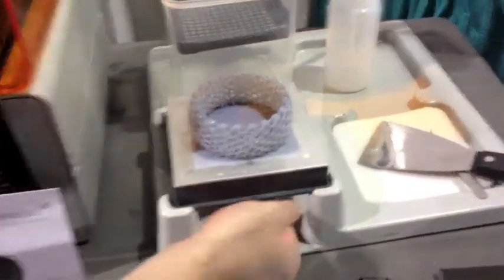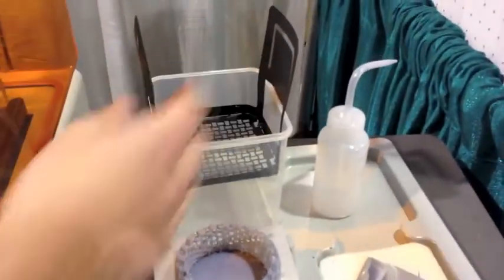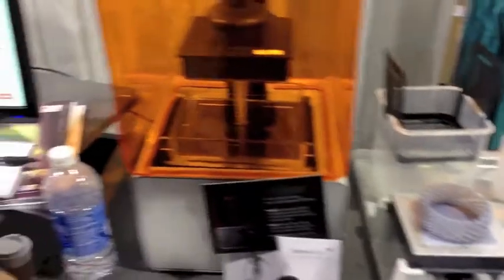This is the finishing kit here. You bring a part over — when it comes out of the machine, it has a little resin on it. You set it down in this little jig here, then you break the part off, put it in a bath of isopropyl alcohol, rinse it there for a couple of minutes, then take it out and dry it off, and it's ready to go.